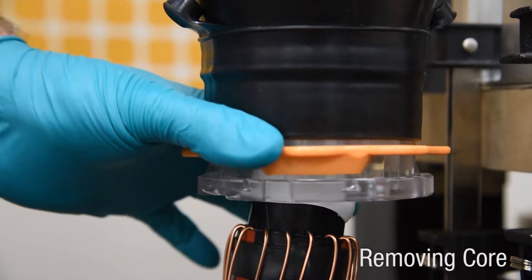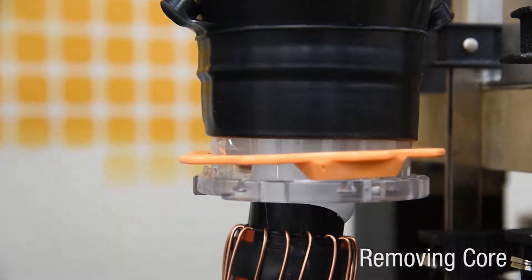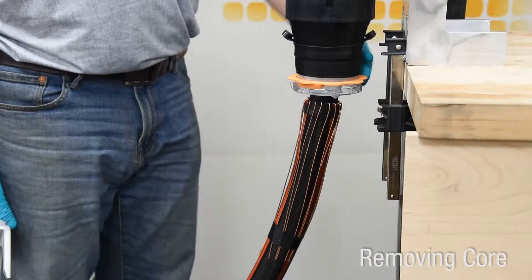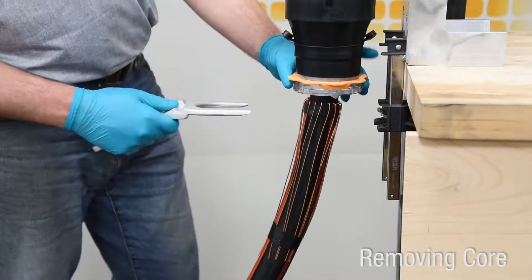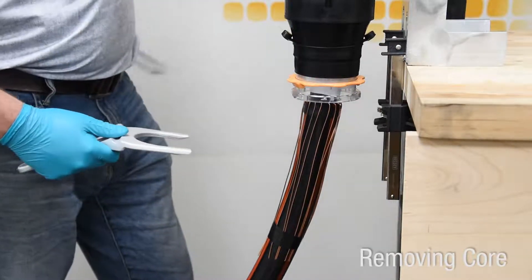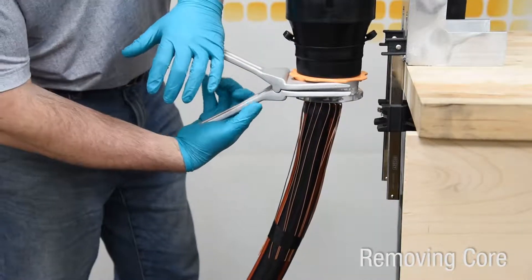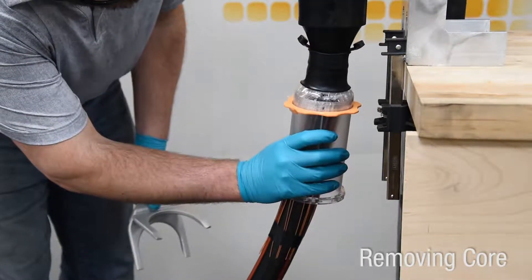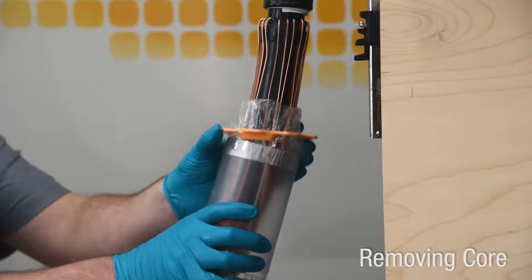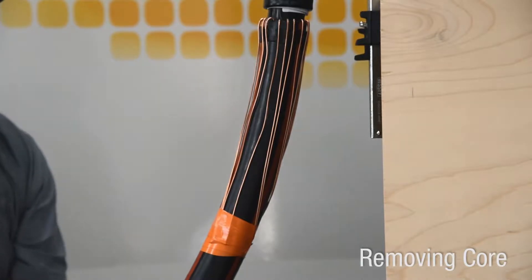Grasp the removal ring and push it against the core flange. Twist so that the cutting teeth break the tape on both sides. The core may be removed by hand. A core removal tool is useful in installations where space is limited — insert one half of the tool and pry slightly to make room for the second half, then bring the handles together to eject the core from the housing. Completely remove the core from the rubber housing by hand; do not twist the core while removing. Separate the core into two halves and clip any remaining plastic rings on the cable. Dispose of or recycle the core.